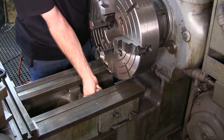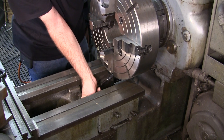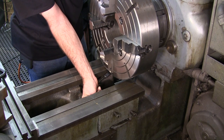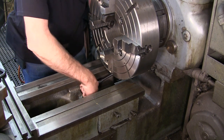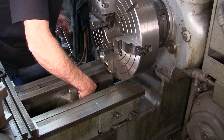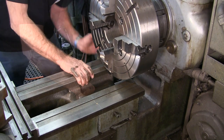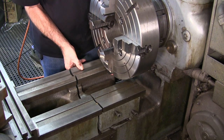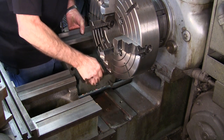It's a little easier when the three-jaw is in here and you're not so tight and cramped, but it's nice that the gap will still slide out of this opening with the four-jaw. My other chuck was a quarter inch larger in diameter and I was able to do it with that, so this one here is no different in that respect. We just palm it, break it loose — it floats on oil, it's really easy to move around once you break it, then you break the suction loose and bring it up and out.